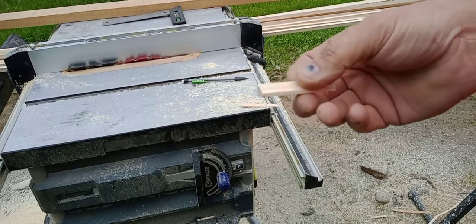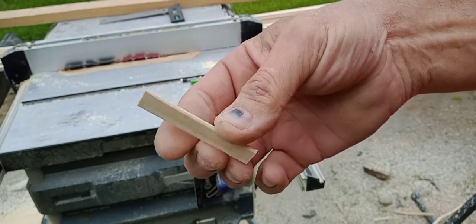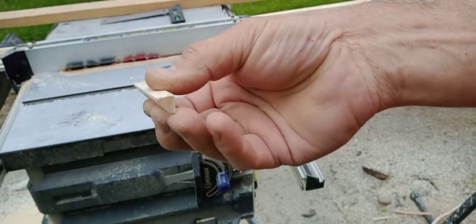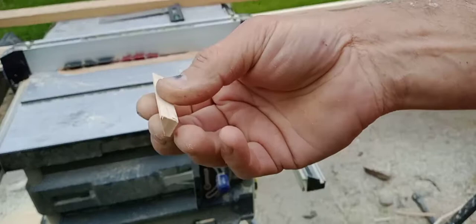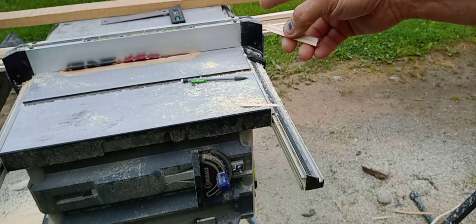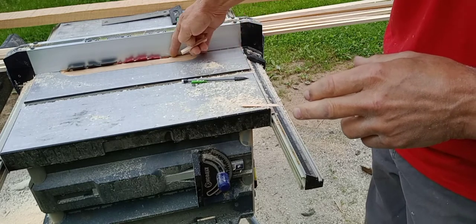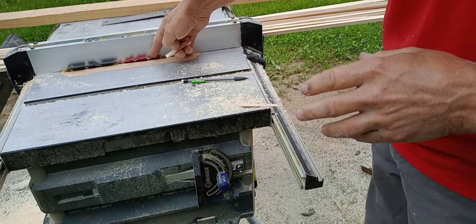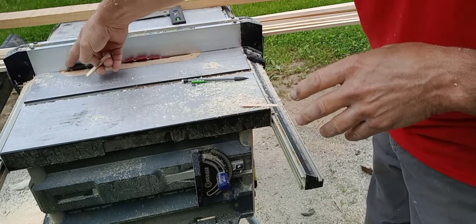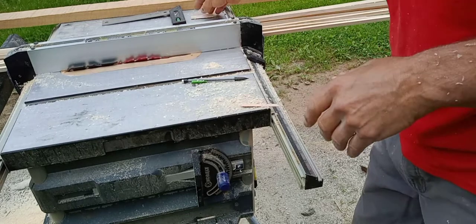Before I went very far, I went inside and dry-fit this on my aileron spar web, and made sure it was going to have the right angle and everything else — and it's perfect. So we're going to keep on going and running. This is kind of a hairy setup — basically it's coming straight off the table, and it's such a light piece it's not wanting to do anything. I hold it mostly against the fence, and then it rests on the riving blade right there on the way out. That's how I'm doing it.